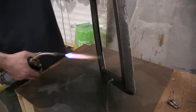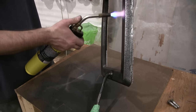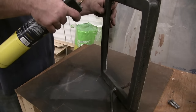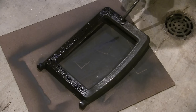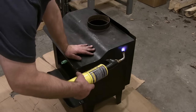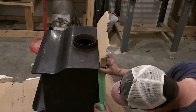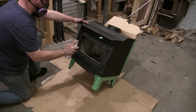I have the room nice and warm but the metal is still pretty cold. If you heat it up a little bit you can see moisture coming right out of it, so I warm it up until the moisture comes out, then let it cool down to where it's not going to burn the paint and won't burn my hand, but it's still warm to the touch — then I paint it. I do the same thing with the stove, just make sure it's not too hot. I'm going to paint the body of the stove red and the legs and the back black.